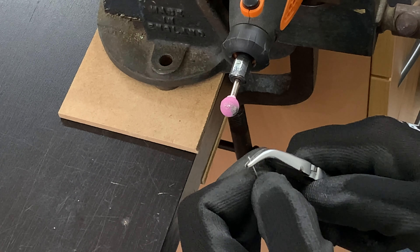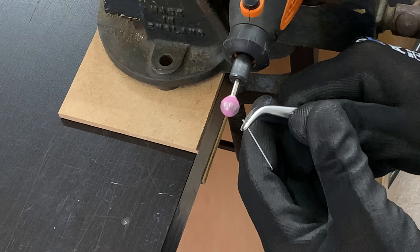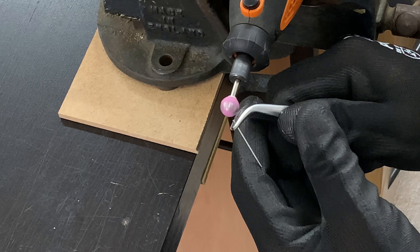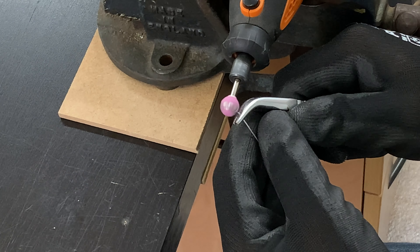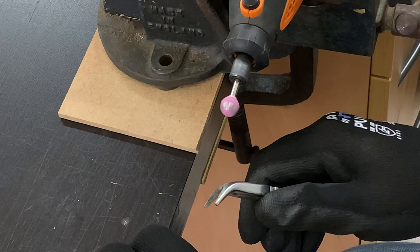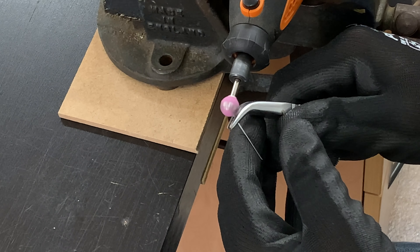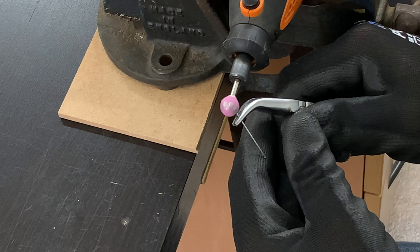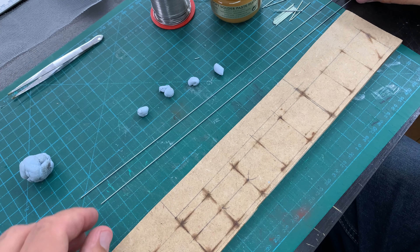Next I'm removing the burrs. I've got my Dremel held in the device using the spherical grinder so I can move it gently underneath just to take away the burr. It's very important to hold the wire as close as possible to the end, otherwise the pressure of the ball will bend and put it out of shape. Very little pressure is required — all it's looking to do is take off the very sharp part of the burr. The soldering will actually make any holes or gaps between the uprights and the parallel bars disappear.